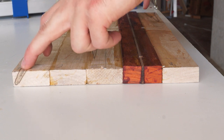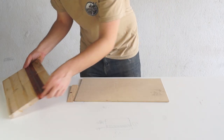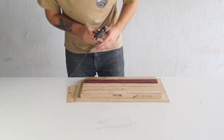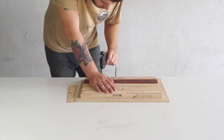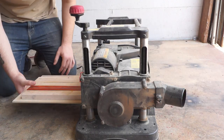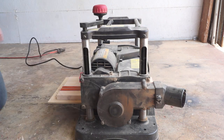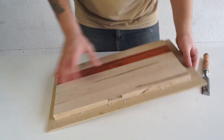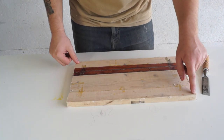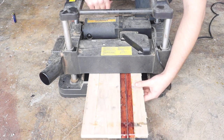Your board probably isn't going to sit perfectly flat, and if you're using a lunchbox planer a really cool trick is to hot-glue your board down to a piece of MDF. If it's really wobbly you can use a wedge to make sure it stays flat. This way the board has a perfect reference for flat and won't move as it goes through the planer. When you take it off the MDF you should see it doesn't wobble at all, and because this side is flat you already have a perfect flat reference.